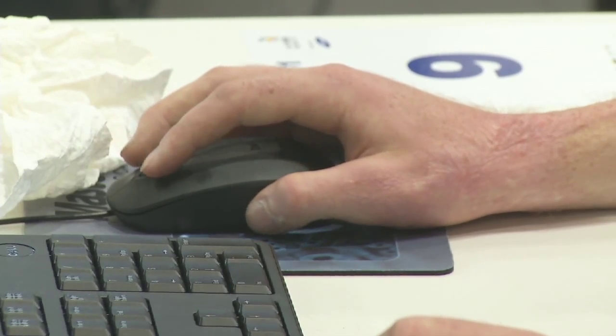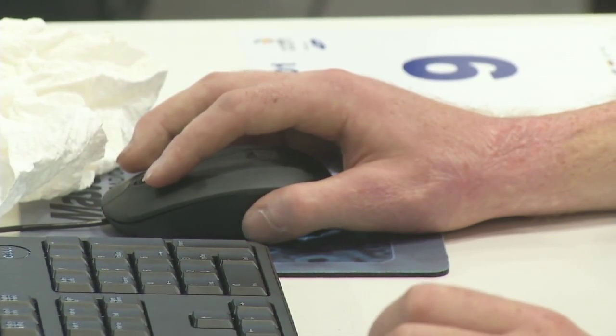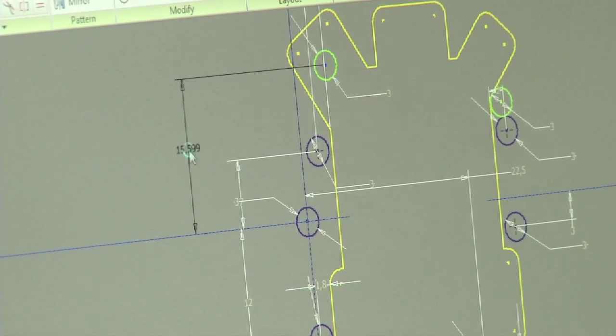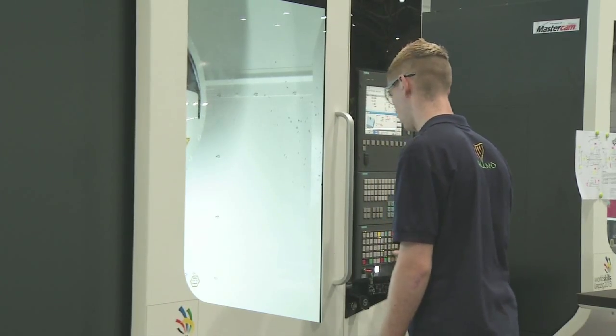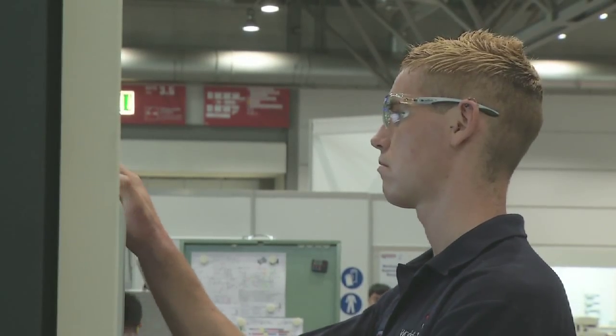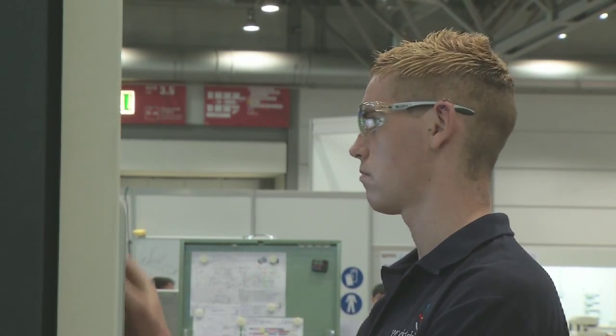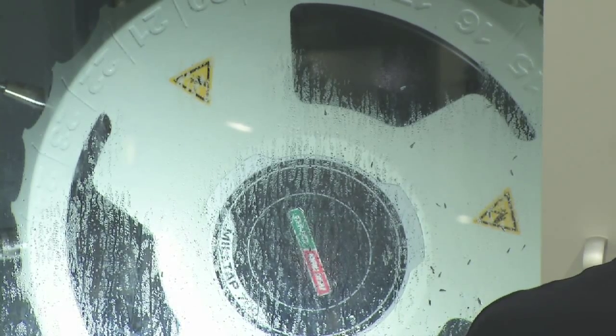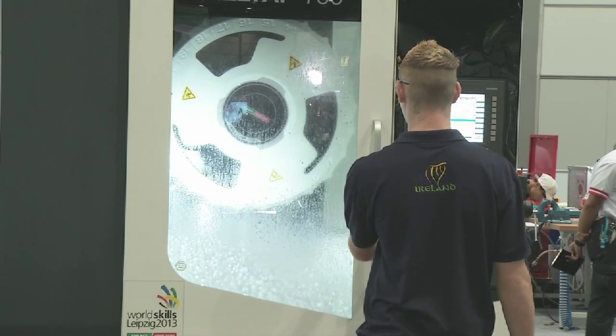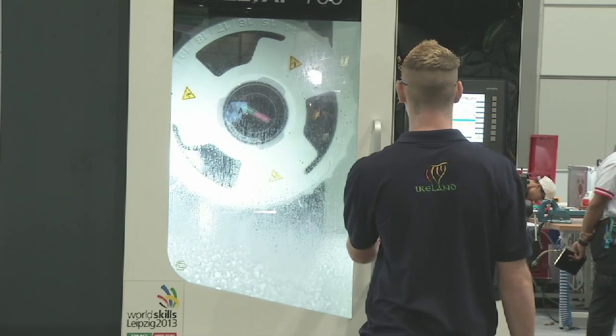Basically, you're given a plastic drawing of the plastic part and from that you have to create a mould — a core and a cavity. We make the core and cavity out of metal, and then we inject the plastic through the sprue, which is where the plastic is fed through. It fills into the core and cavity, takes that moulded shape, and then it's released off the moulding machine and the part falls down.